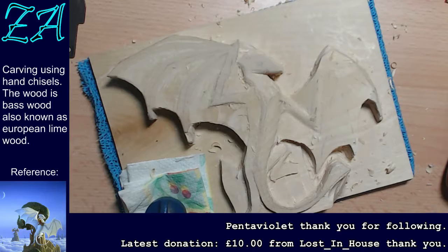it kind of doesn't surprise me, because all the anodizing process does really is artificially rust the aluminium, and aluminium oxide is really hard. I mean, after all, aluminium oxide is one of the things that they use for things like sandpaper and garnet paper, so it's a really hard substance. And then of course, because it's full of tiny holes, they fill them with the dye. But